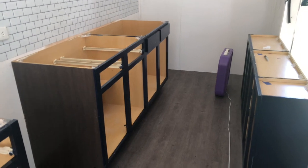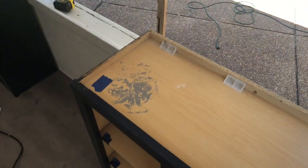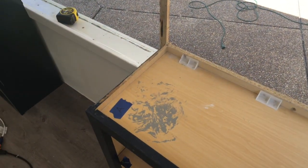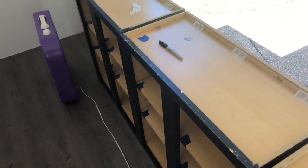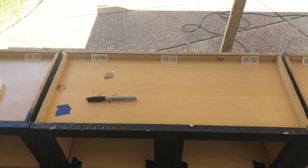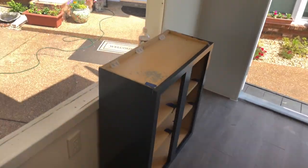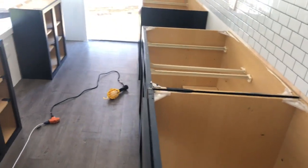What I'll do is cut these down. For the wall cabinet side, I'll take two of those white wood pieces and cut them down to about 13 inches deep, going about 13 feet long — from the end of this cabinet all the way to the wall. Then over on the base cabinet side, I'll cut them down to about 25 inches deep.